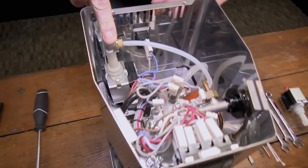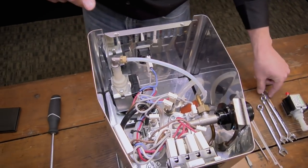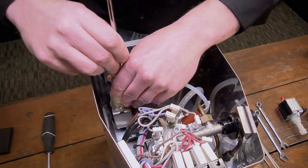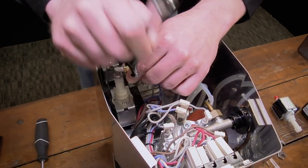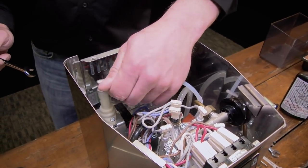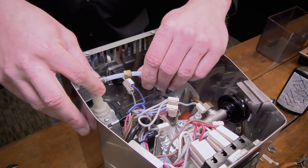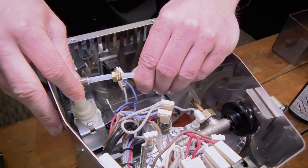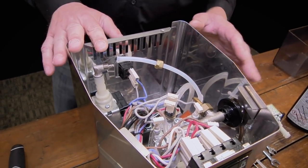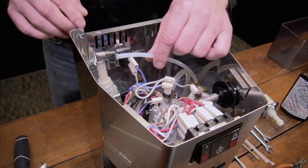Now the pump is right here. What we have to do is remove this line, which uses the 12 millimeter wrench. Go ahead and break that free. Once you get it freed up enough, you'll be able to grab it with your fingers and just unscrew it. Once you get it off, you'll see there's a little flare — you basically pull off the tube. Also make sure when you're doing this the machine is powered off and not hot, because it will be extremely warm in here.